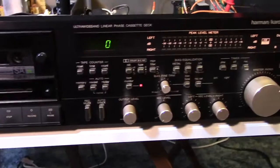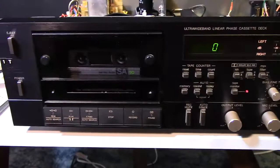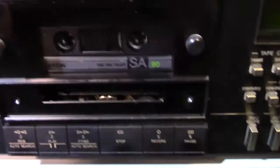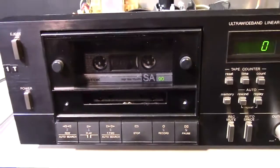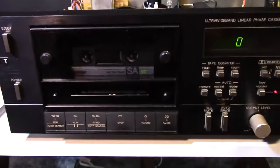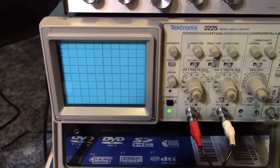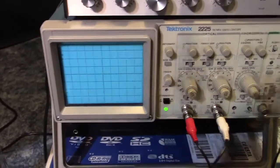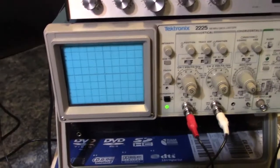So what we're going to do first — this is preliminary checking — whatever you do first with a cassette deck is check azimuth alignment. I've got a reference azimuth tape recorded on a reference deck, and I'm going to play that and align it to the oscilloscope. It's a very accurate way of aligning the azimuth — you get the line to go sideways and not in a circle. Let me put the camera on the tripod.